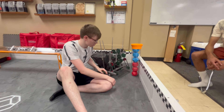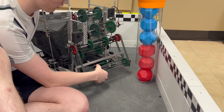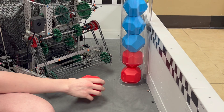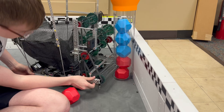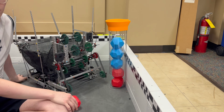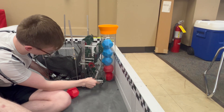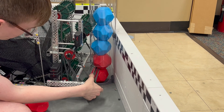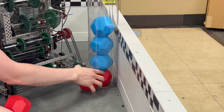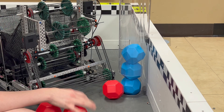I'm going to be showing off our innovative first stage roller system. We wanted something that was a static mounted roller, so a rubber band roller was ideal because you have the compression from the intake in the roller rather than doing a floating style intake — that compression comes with the rubber bands. One challenge we faced was getting match loads from the match loader; the axle conflicts with taking in those match loads. So Prith suggested: what if we just had no axle at all? And the Prith roller was born. The idea is that we go up to the goal at the match loader and intake, and it'll pull them in. Because there's no axle in there, when the motor is running at full speed the axle won't conflict, so we'll be able to pull out one ball while pulling the next one down and forward — the ball can go straight into the robot without running into an axle.